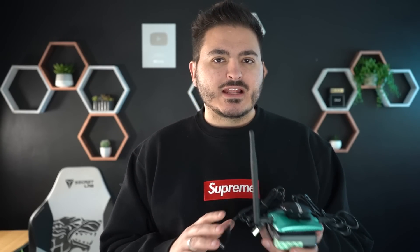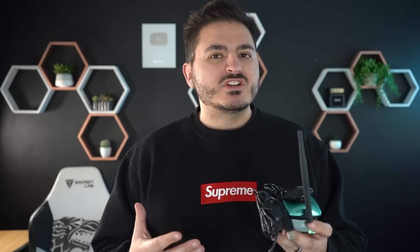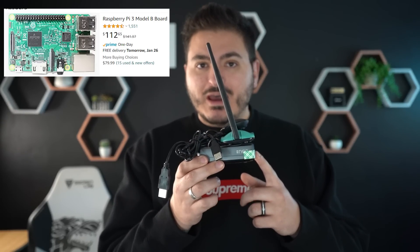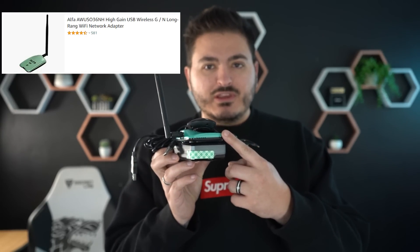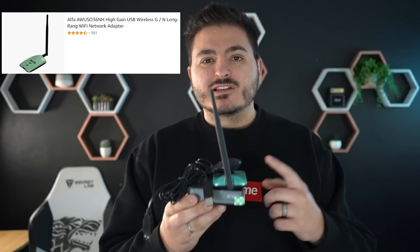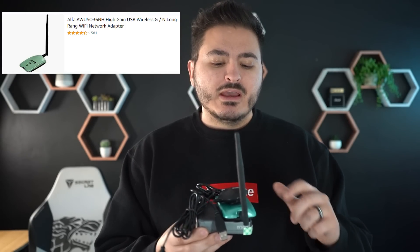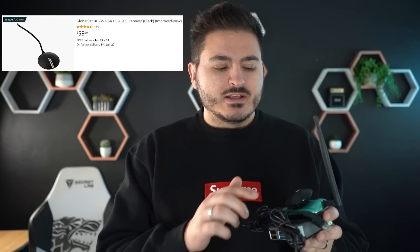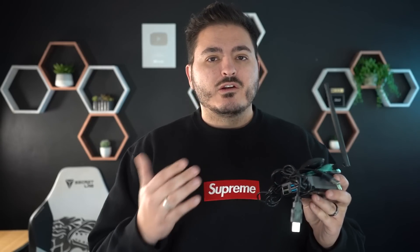So we have the drone that flies around, but what do we put on top of it to actually collect all this data? This is the setup I had - just what was laying around my house. This can be done more efficiently, but this all works really well. On the bottom right is a Raspberry Pi 3. The little blue thing is an Alpha wireless card, which allows me to do injection and see what networks are around. On top of this is just a GPS dongle that gives me GPS coordinates.